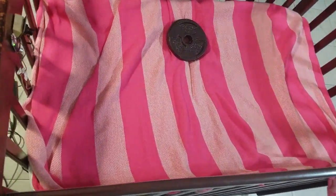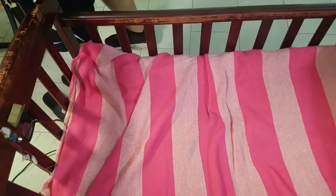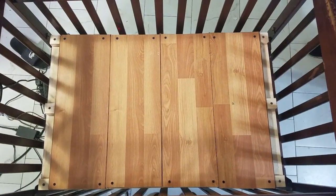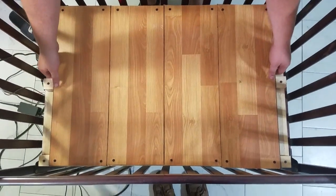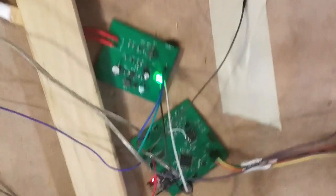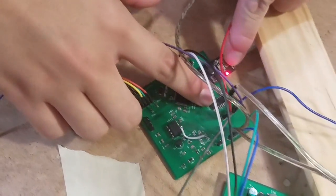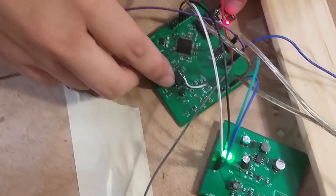Let's go ahead and look at some of our different hardware. First we're going to take a look inside. One thing to note is we did have to use a different sound sensor than shown in the presentation — a smaller sound sensor that runs off five volts. That's the base we created for the weight sensors, and at the very corners underneath are four weight sensors. Here's a look at all four of them, and now here's a look at the main PCB board. This is the main PCB where we have the Wi-Fi module with the main MCU, the INA amplifier for the weight sensors, and the sound sensor system with the 555 timer trigger.